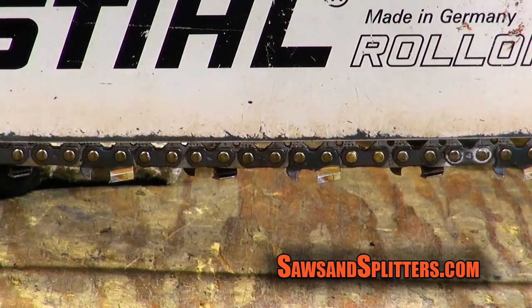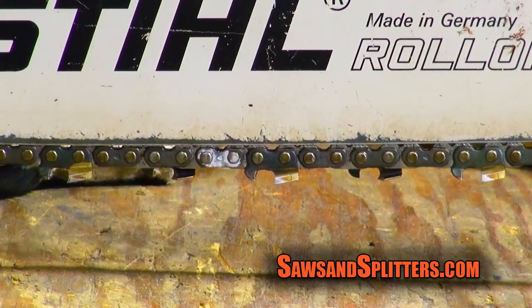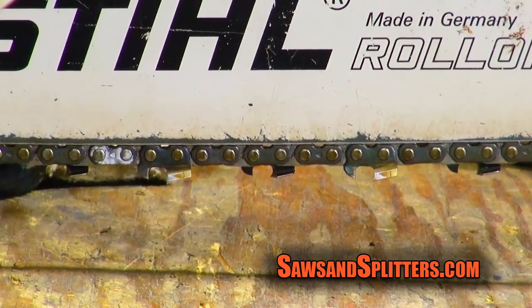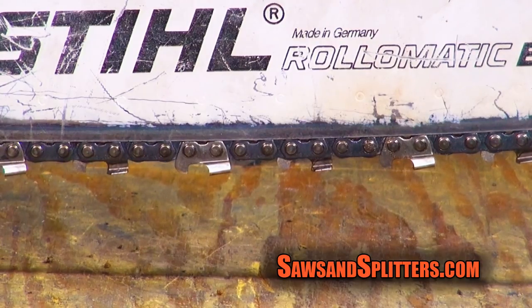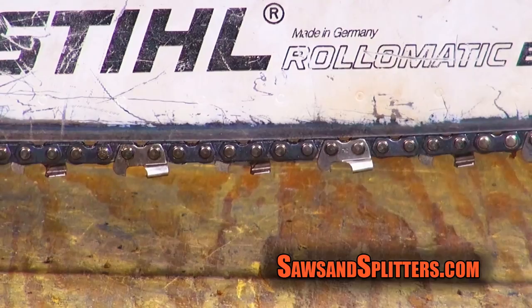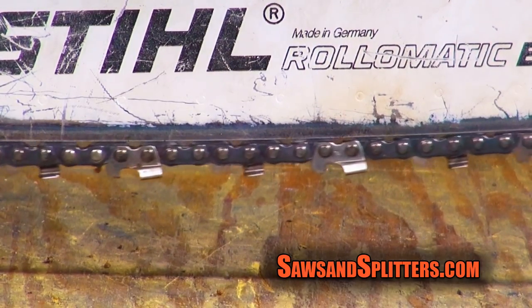You can see how the chain is down right now, and there's just no consistency to this chain. I tighten it up — everything looks snug — and then I move the chain and it pops out. Snug, pops out. Snug, pops out. The chain I have on now is Oregon ripping chain, 72RD, with a 20-inch bar — and I'm getting the same results with a different chain and a different bar. Which means it's got to be something farther back.